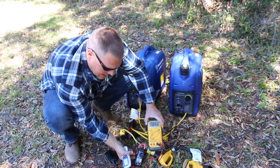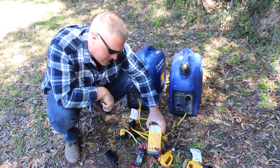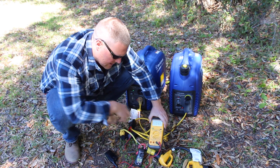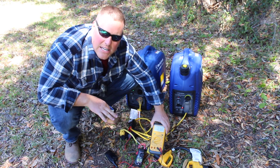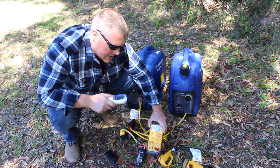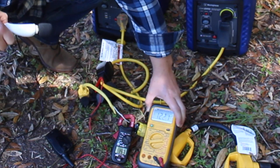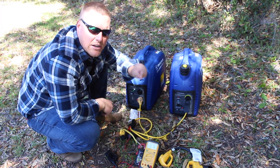We're reading 3.7 amps and that compressor kicks on — you'll see this drop here. We came all the way down to 77 volts until we jumped back up, now at 121 volts. We're reading 14.5 to 15 amps, and it was this one that took a while to kick in.